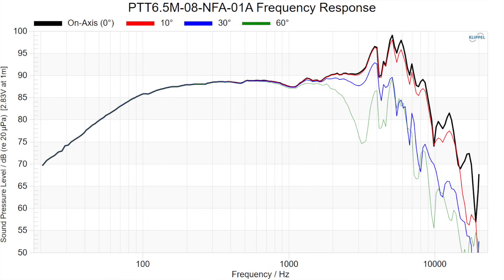The price for this particular drive unit on Purify's website direct is $385 USD each. The frequency response shows an average sensitivity of about 88 dB at 2.83 volts one meter, and at about 80 to 90 hertz you're about 3 dB down from that mean average. Breakup starts to occur around 3 kilohertz and beaming starts to occur at around 1.8 kilohertz due to the actual diameter of the speaker. You could take a notch filter at around 3 kilohertz and drop that down.